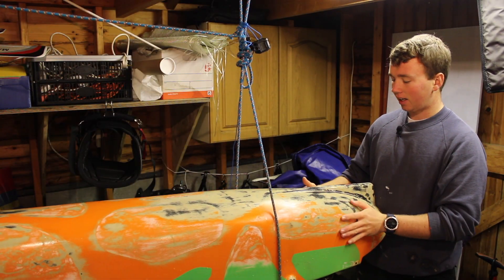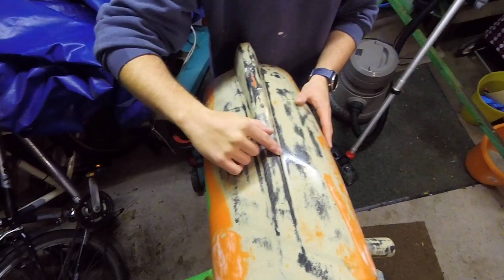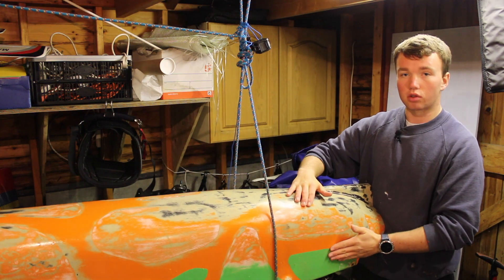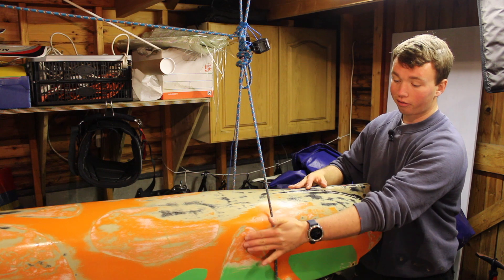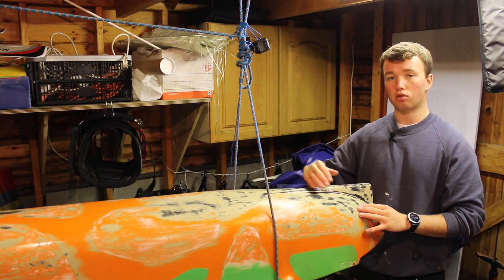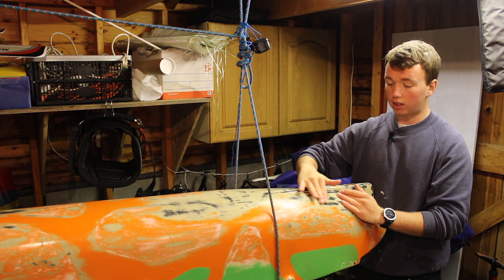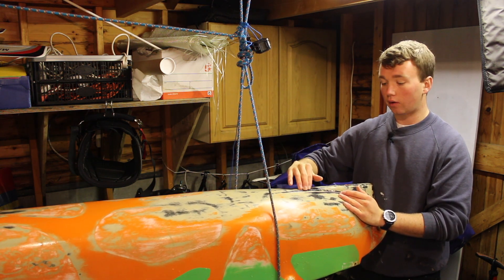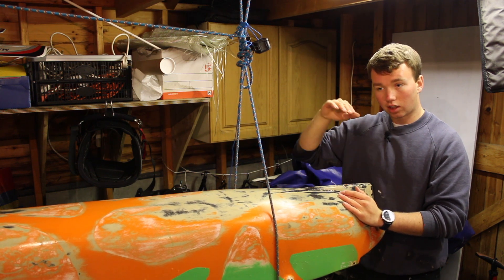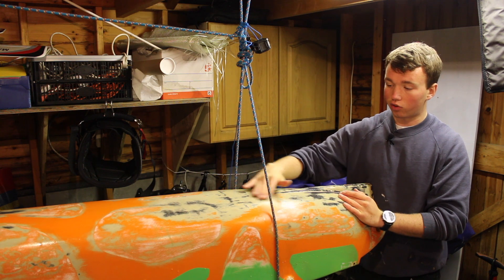I'm in the process of sanding back the stern area. The black you can see is the carbon, the grey colour is the undercoat, the orange is the first layer of top coat, and the green is top coat on top of that. I'm going to sand the green away first, then flatten the whole area back to make it nice and smooth. The green is always slightly higher than the orange because it was painted on top. I don't want to go any further than back to the carbon — if I go further it's going to start to dig into the carbon, which I don't want. So I'm going to have a mixture of orange, grey, and black as I go forward.